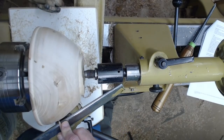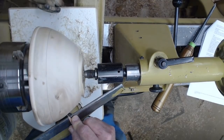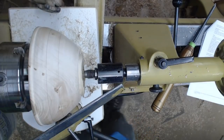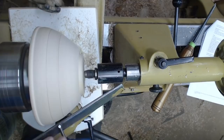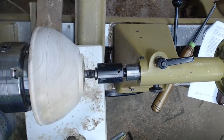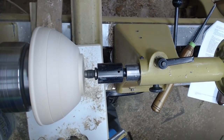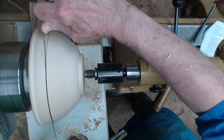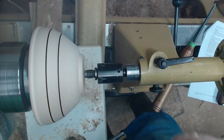I'm going to mark a line where I'll do the Zentangle on the inside, mark that, and then take a point tool and put a tiny V-groove there to use for my burn wire. Get the speed up a little bit and just come in here — just enough to hold that burn wire. It's a guitar string with a ball on each end. You need a little bit of speed to get a good burn mark.